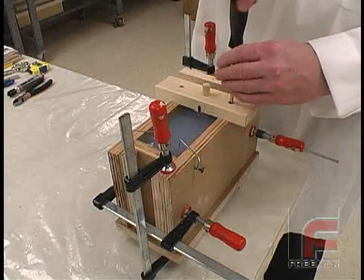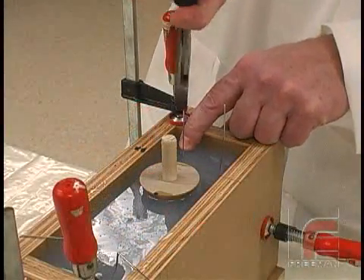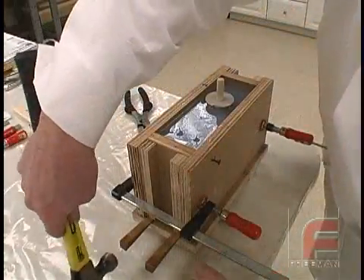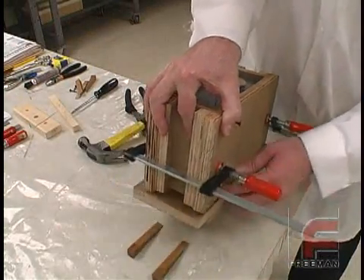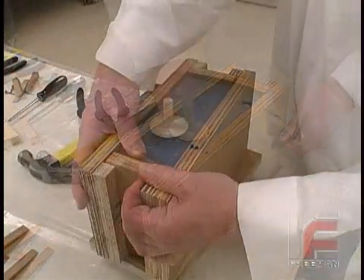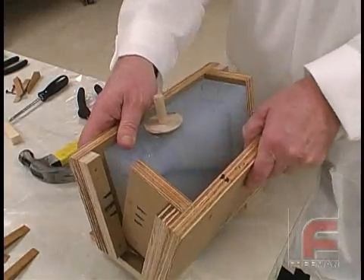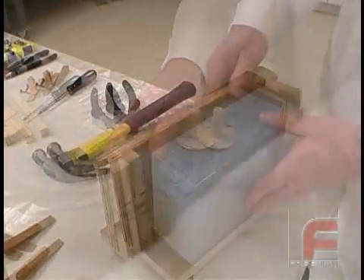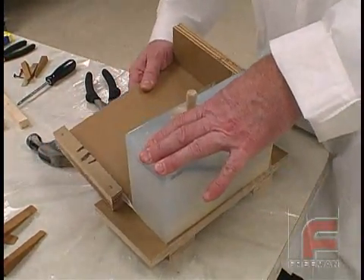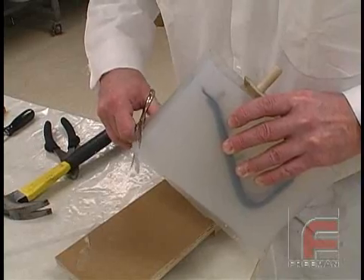The next day, we unscrew and then lift the piece of wood that held our down-sprue. Next, we are pulling two of our vents out of the mold. Then we remove the first two clamps and remove the mold box from the mold bottom. Next, we remove our last two clamps and pry the two halves apart, revealing our clear mold. As you can see, most of the surface bubbles that appeared at the end of our pour have broken as the mold cured. Here we are removing the flashing around the mold, which was created when the silicone rubber seeped between the plywood sections.